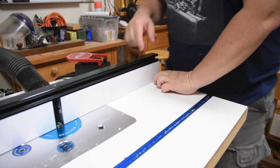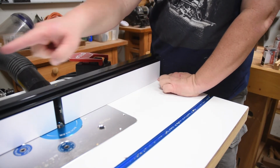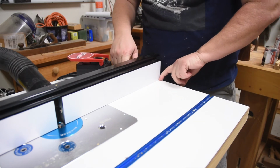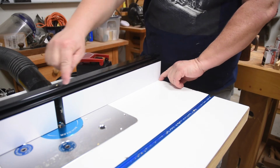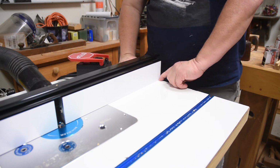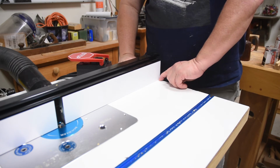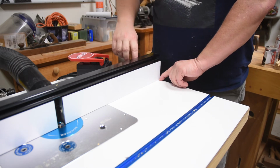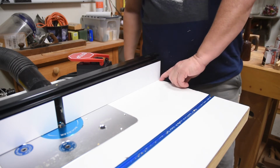Now in adjusting how much more to take off, I do know if I have an anchor point on that side and an anchor point on this side, if I put my finger right here and loosen this side up, because this is half the distance, I can basically adjust how big a gap I want by doing double the distance between my fingernail and however much I move it over. I close that up and let's test it out and see how much of a gap I have.